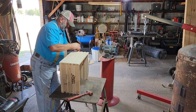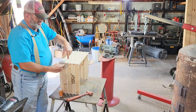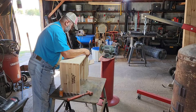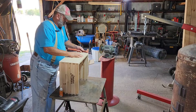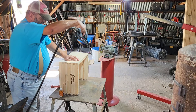Even though we're gluing these, we're still going to use some nails, and we'll nail them from both sides — down this way and this way — so it's not just the nails simply pulling out; they can't pull out if there's nails going two directions. Let's see if this one goes together as easy. Not quite as easy, but I was still able to push it together. I love this dovetail joinery — it's really nice. Seeing how this one is nice and tight, I want to put a couple nails in it to hold it.